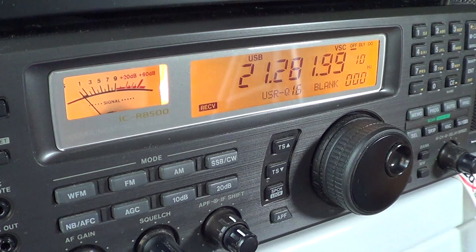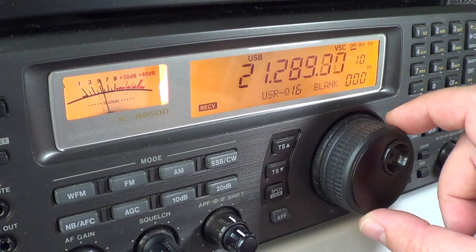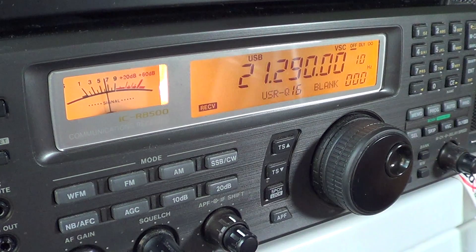But it can go up to late evening when propagation conditions are good and solar activity is high. It can also be an all-nighter, especially in the summer — I've noticed summer reception sometimes going all through the night when solar activity is very high. You'll hear stations from all over the world on 15 meters, and actually it's the only band where I've ever received Japanese stations from ham radio operators. It's a really good band.